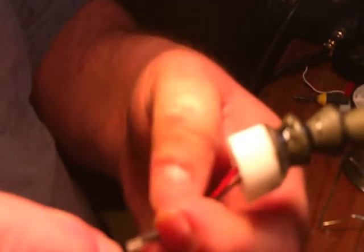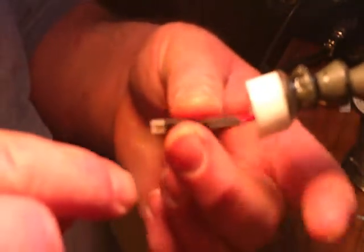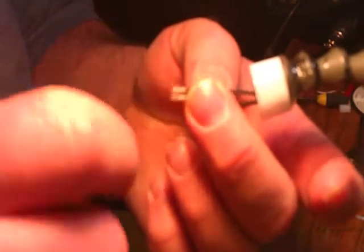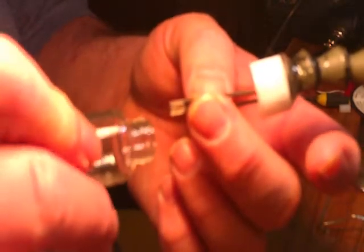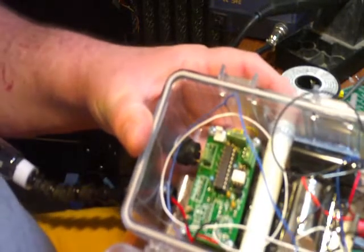I'll put an O-ring in there to help seal it and pull my wires up a little bit. This type of emitter has a little button on one side — this is what has to face the other camera. That little button has to face your camera or your flash from your trail cam. And that's what the end will look like.